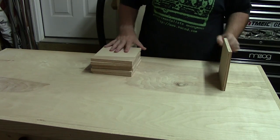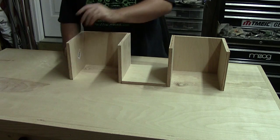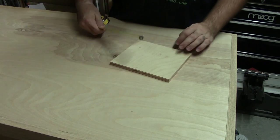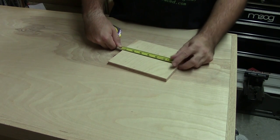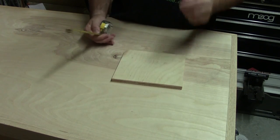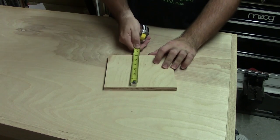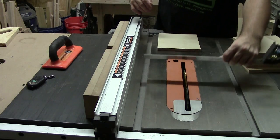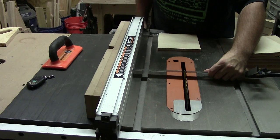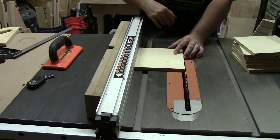So I'm thinking about something like this. In that configuration we have four shelves. All these panels were cut the same when I cut the drawers but they're a little bit off. This one is a little over 7 inches and this one is six and a half on the mark. So to maximize our use of these, we'll cut the little over seven inch length down to six and a half to match, and we'll have a perfect fit. Set the fence to six and a half inches, and we can take our piece that was six and a half inches to gauge it — it looks like it's right on.